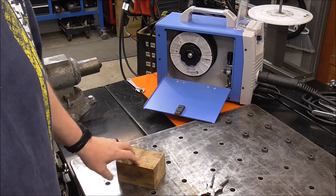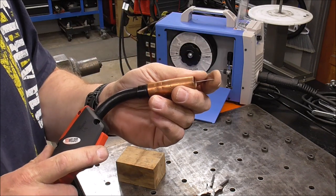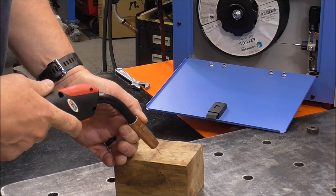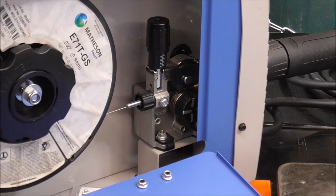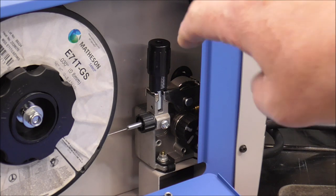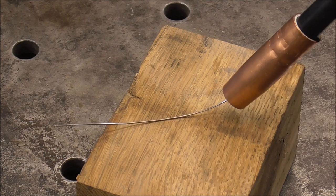I'm going to show you how to set that up properly. Grab a block of wood and set it on your workbench. Watch this reel — I'm going to pull the trigger and let a little wire come out, about an inch sticking out. I'll hold the MIG gun at about a 45-degree angle and watch what happens. The wire stopped moving — that means the drive rolls are slipping because I'm still pulling the trigger. You can see the drive reel is spinning but the wire reel is not feeding any wire. There's not enough tension to force the wire through.